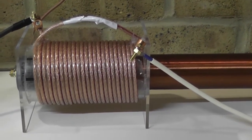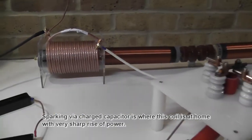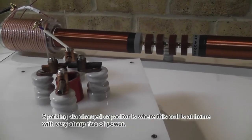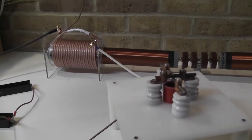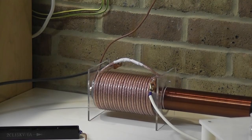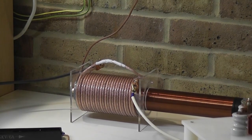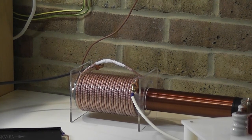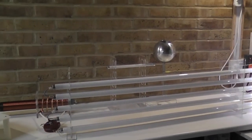However, now in my high voltage charge system let's have a look. Bear in mind I currently have 0.3mm gap — I will probably have to reduce that because this coil is amazing. I have the Bifilar coil now connected and we will see how that works. At 0.3mm, the same value — by the way it was 170 watts — let's go and see. The power level going through the system is tremendous. The spark gap alone is now 4cm long, up from 1cm, and it goes all the way through. At 0.1mm I could achieve the same results using only 45 watts — not even half — and achieved the same output.